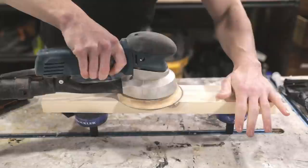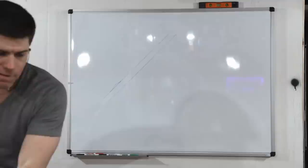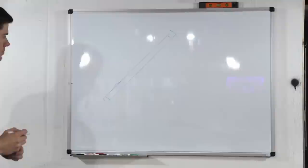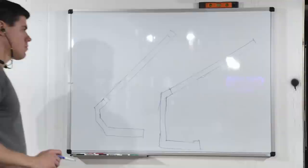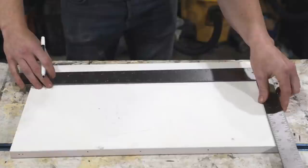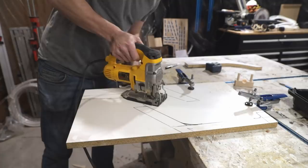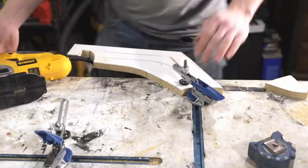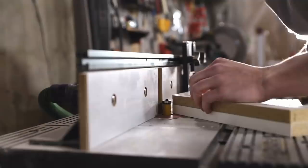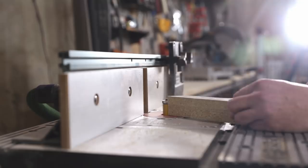This was a design-as-I-go project, and I didn't really know the shape of the lamp, so I thought I'd share that process. I held the body of the lamp up to the board, traced it to scale, and started drawing shapes — started with an octagon shape that I didn't really like, then tried a more squared-off shape and didn't like that either. I finally came up with a sort of kickback angle that I ultimately ended up doing. I measured the actual angles drawn on the whiteboard, transferred that shape over to a sheet of melamine, and cut out the concrete form with my jigsaw. I carefully cut one side, then used double-sided tape to stick the two sides together and used a flush trim bit on the router to make them even — though you could also use a jigsaw and sander.